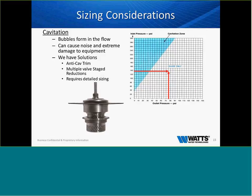That is exactly what happens coming through the valve. So as we're coming in through the valve, you drop from atmospheric to subatmospheric pressure. And as you go over the seat of the valve, it's introduced back into atmospheric pressure. So in the seat of the valve is where cavitation occurs. And what happens is, when the oxygen separates itself from the water, these small bubbles are formed. When these bubbles are formed, they don't explode, they implode. And when they implode, they take everything they come in contact with. Doesn't matter if it's stainless steel, Hastelloy, ductile iron, aluminum, nickel, bronze, it doesn't matter. It is detrimental to anything that it touches.